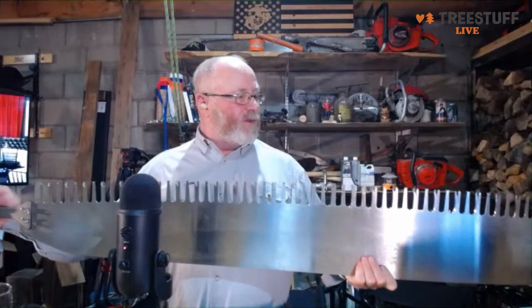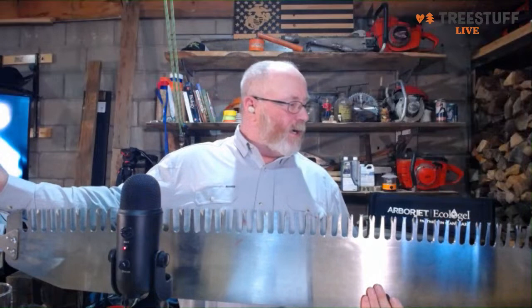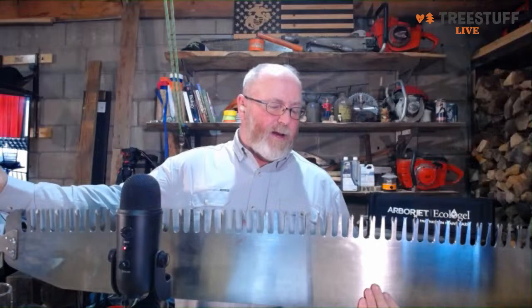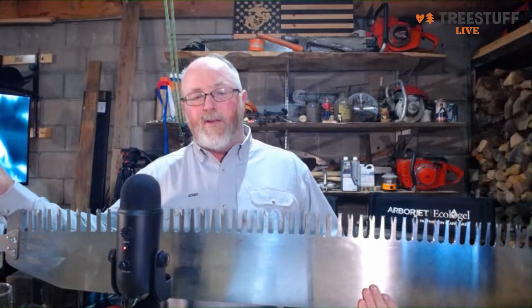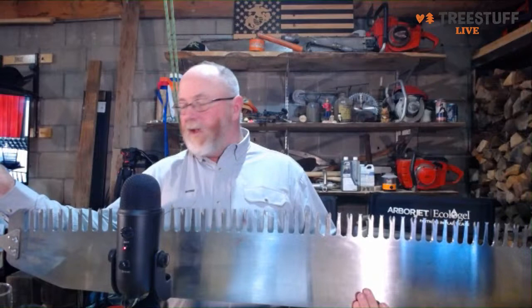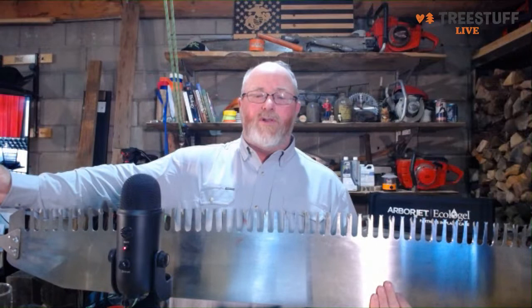A lot different than the saw that they're going to find at a garage sale or grandpa's farm. But this thing is polished, smooth. The teeth are set to within a thousandth of an inch. When we got this, when I started tuning it, they had teeth that were almost 30 thousandths off. And you think about these cuts going through the kerf, and if the teeth are not true, they rub on the side of the kerf and it stops the saw in its tracks. So we have a large granite table that we set this on, and we tune this to as close to dead nuts accurate as we possibly can to eliminate resistance when they cut.